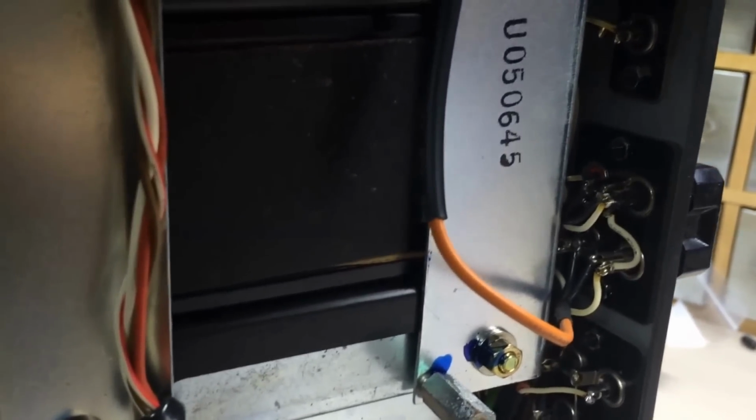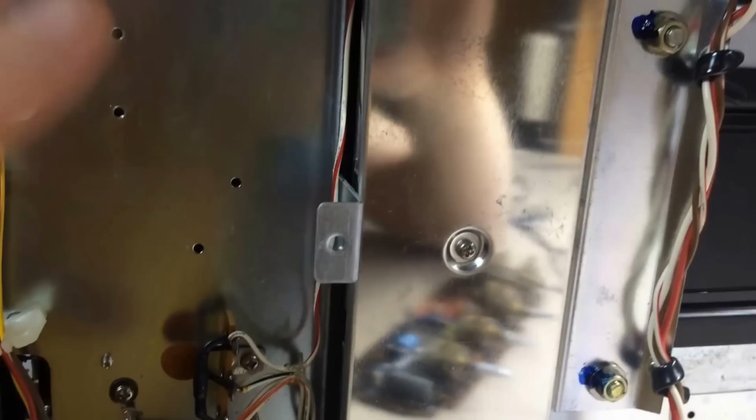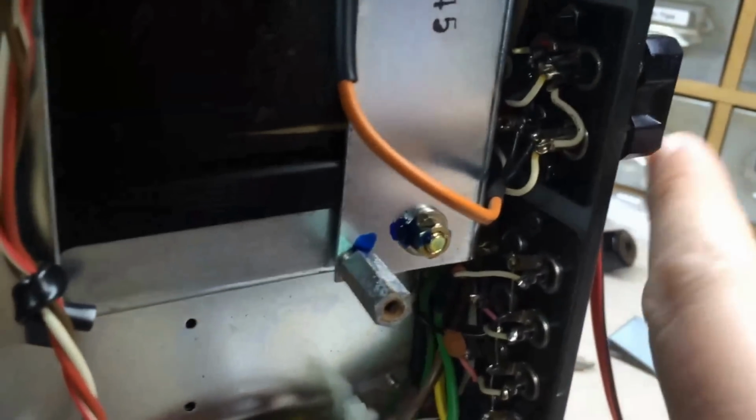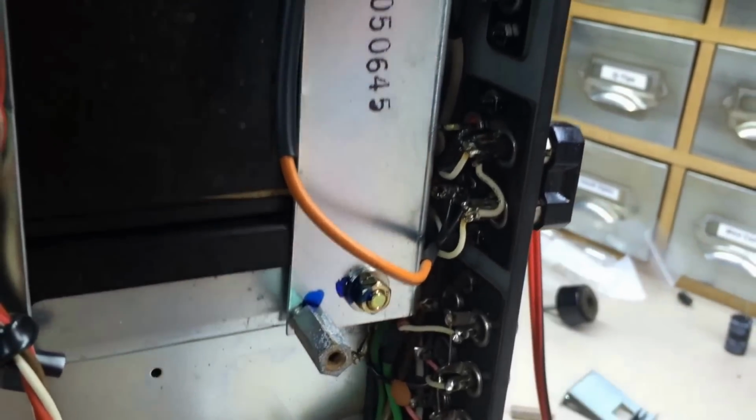What happens is your signal comes in, goes through the volume knob, goes through the tone controls, comes out the back side of that, goes into the driver board itself, comes out of the driver board, and then feeds the power amplifiers. But between all of that and the power amplifiers, they put a set of jumpers. If you remove the jumpers, you can use the front end of the amp and go out the pre-out to simply feed into another amplifier.